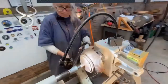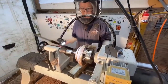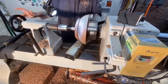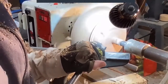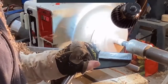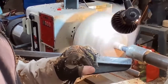Now I'm just going to go in and continue shaping around that arc so that I end where I want at the bottom. This is always a little unnerving because there is a chance that you will guesstimate wrong and go through the bottom of the bowl — that has certainly happened. I have a wall of shame in the background: basically funnels that were supposed to be bowls. This is just taking that tenon off and shaping it so it has a really nice curve. When it goes well, it's a beautiful thing.